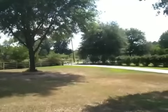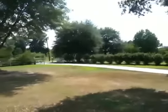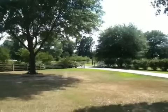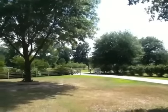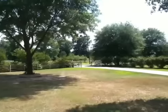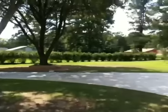You can see the sun on it right now, but you can't even feel it — the windows are just as cool as the walls. It's already made a difference in just a few minutes. Alright, that's the end of that project. My next project: at the end of my driveway I'm going to make a really nice double iron gate. I found the metal. I'm going to sink a couple of six-by-sixes — 16-foot long — in the ground, not quite three feet deep because I need to get my truck underneath. I'll put a six-by-six across the top to keep the poles from sagging from the weight of the iron gates. I can lock them up when I'm gone, and beside it I'll put a little walk-through gate so someone can come read the meter but can't drive off with my lawn mowers.